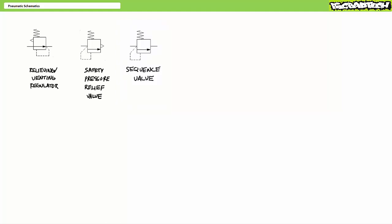I should note that sequence valves in pneumatic systems are sometimes illustrated a little differently than sequence valves in hydraulics. You may also run across pneumatic sequence valves illustrated where the sequence valve is kind of a pilot device — it senses pressure on a sensory pilot passage rather than directly opening its own primary passage; it indirectly causes another valve to do so. Below the set value, the three by two primary valve blocks passage from one to two and vents two to three. When pressure on the sensory pilot passage exceeds the set value, the sequence valve actuates the internal air pilot, which then opens the primary valve's passage one to two. We'll explore pneumatic sequence valves in later lectures.